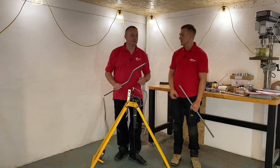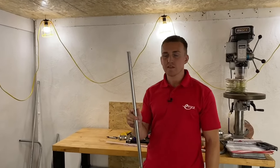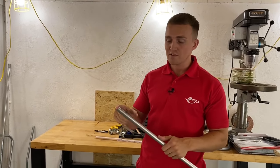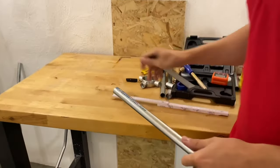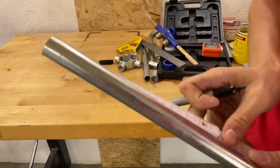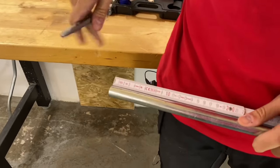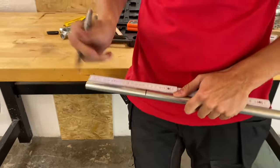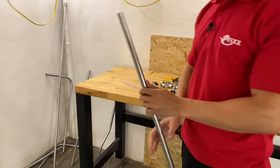We're going to do a double set and it's going to be 50mm off the surface. I've got an offcut of conduit here, I'm going to do a double set in this. I'm going to mark my first bend — the measurement to my first bend is going to be 150mm from this end. Is that a crucial measurement? No, that's not crucial, that's just one I'm going with. Because it's a double set you would think that would be 2x45 degrees, but often we don't pull them to 45 on the first one. I'm going to aim for around 30 degrees.